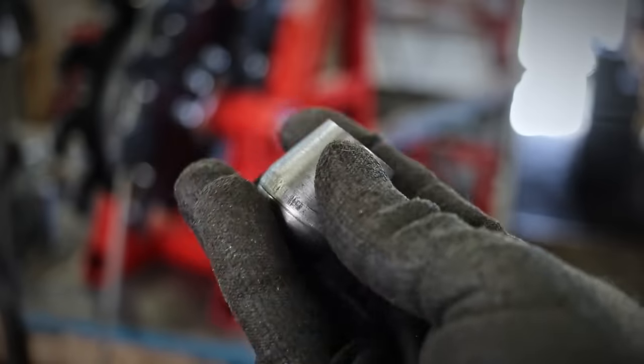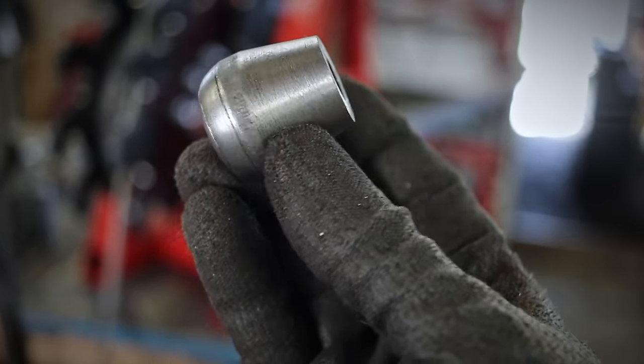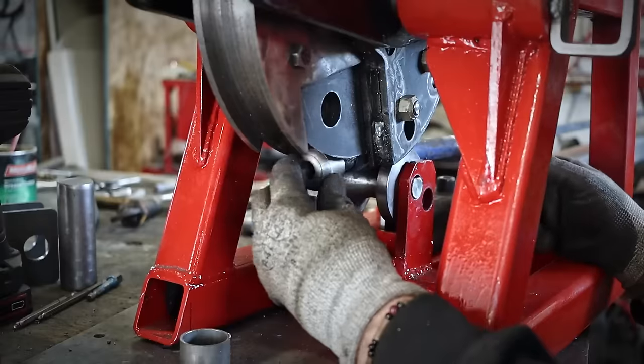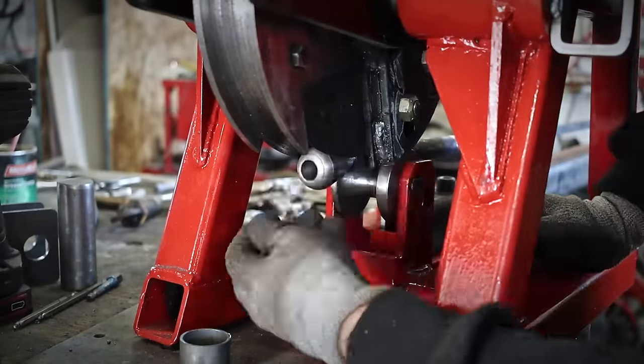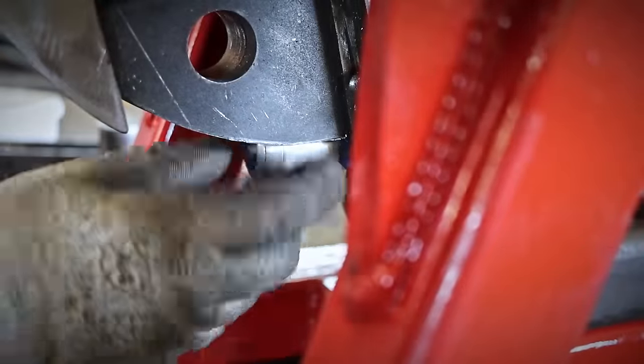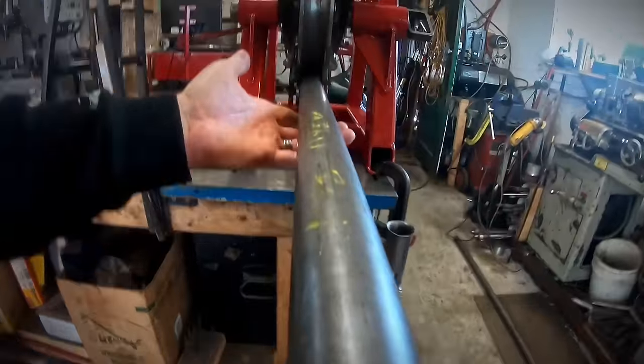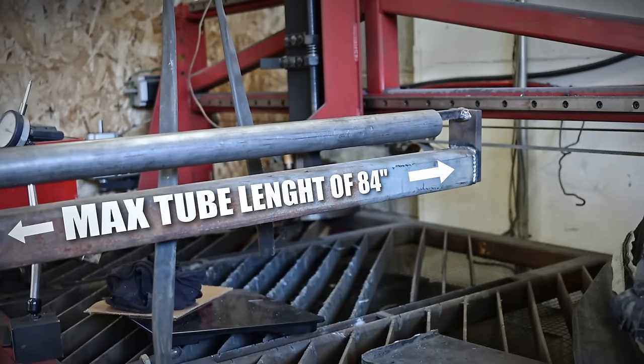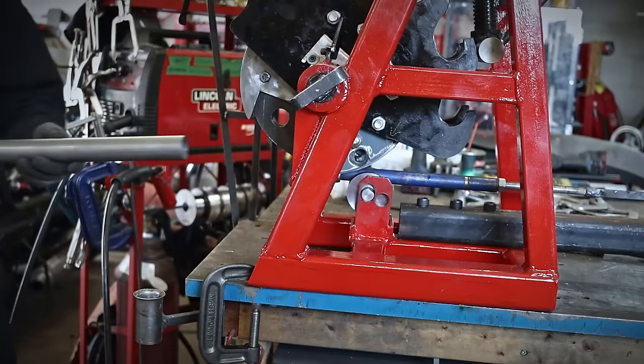And now for the bullet. I saw this device on some really expensive benders. Typically, it's going to be one or two balls. It goes inside the tube and forces it to keep that round shape while it's bending. It's something I had to develop on the first tube bender, having so many problems with the flattening of the tube.